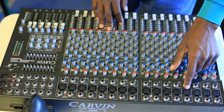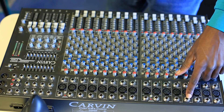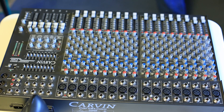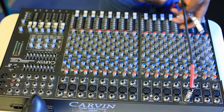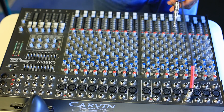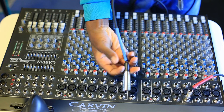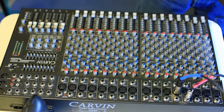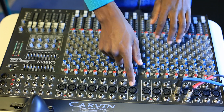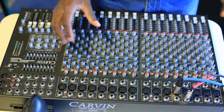The connections originated here on the analog console. You can see here is an XLR input as it looks on an analog console, and here is a TRS quarter-inch input. We can plug the TRS cable in there. The other things are inserts — that's where outboard gear goes, a whole other topic. And here we have the XLR, which I'll plug in — three pins. That's where these connections came from, which is why on the Scarlet you can plug a quarter inch right into the middle of the XLR — it's called a combo jack.